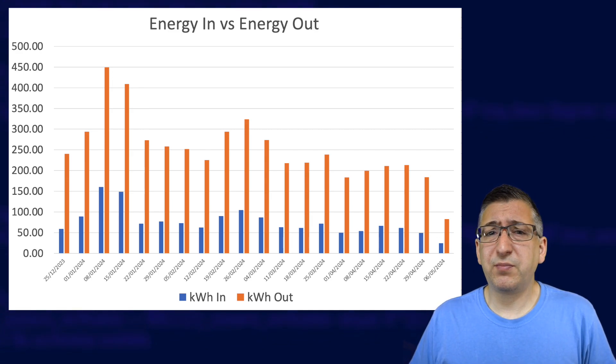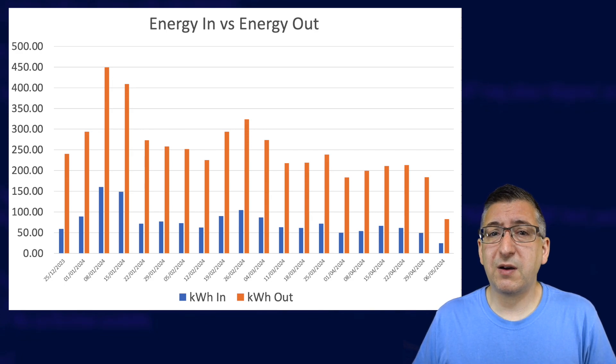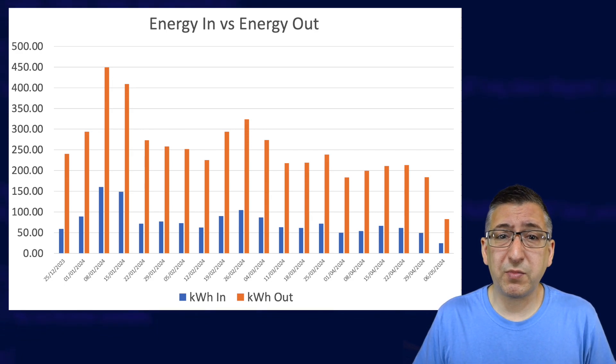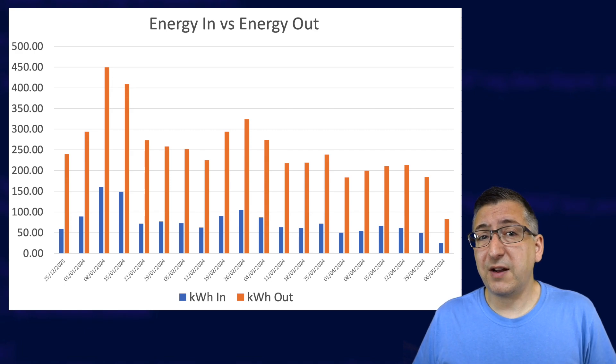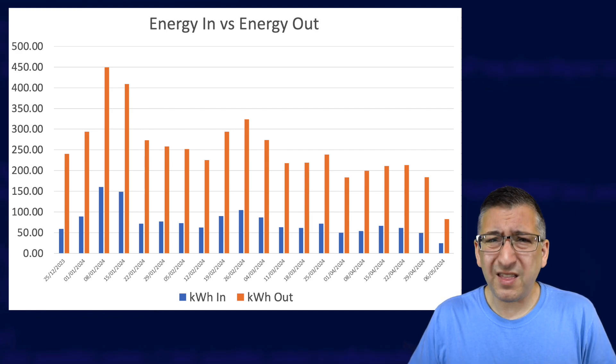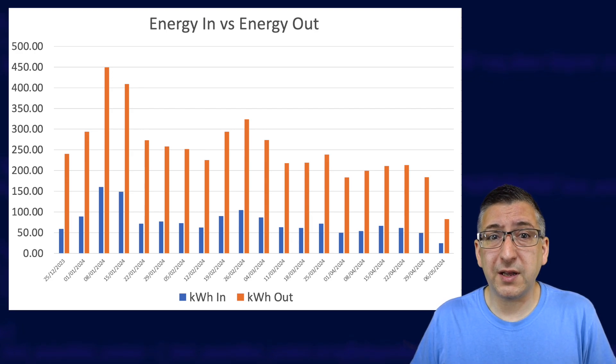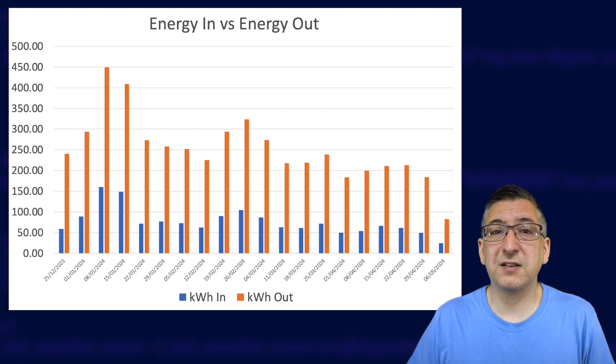The Shelly EM Pro is pretty accurate and I'm happy that it's reporting the correct amount of energy used by the heat pump — it all matches up with what I'm seeing my batteries output and what my smart meter is reporting is being drawn from the grid. The energy out data from the MMI is the lower of the output values, so if I use that to calculate an equivalent gas cost to heat my home and it turns out the heat pump is actually producing more energy, then I save more money. I don't want to be accused of cherry picking data to give the most positive outcome, so I'm cherry picking the data to make it as challenging as possible for the heat pump to compete with gas.